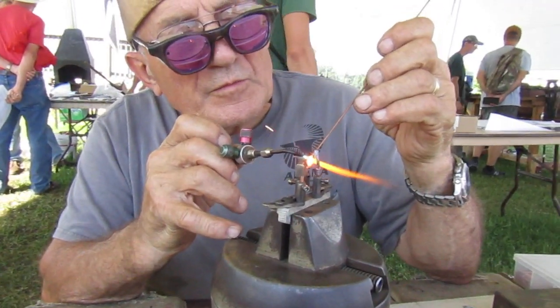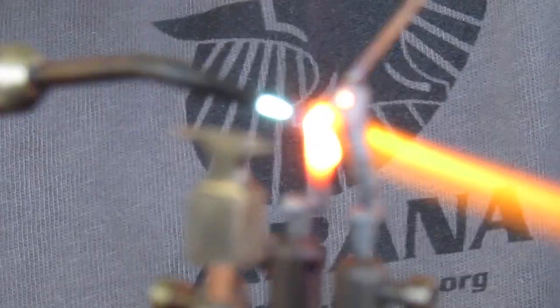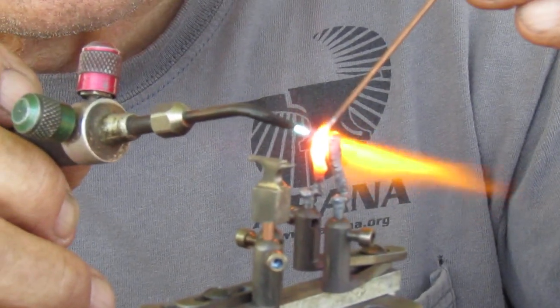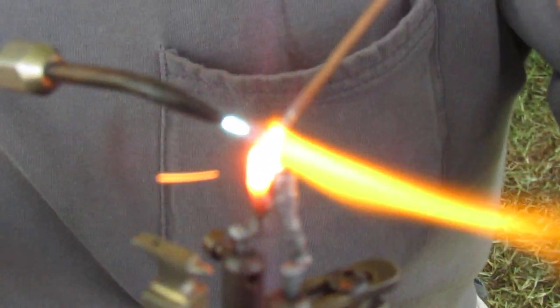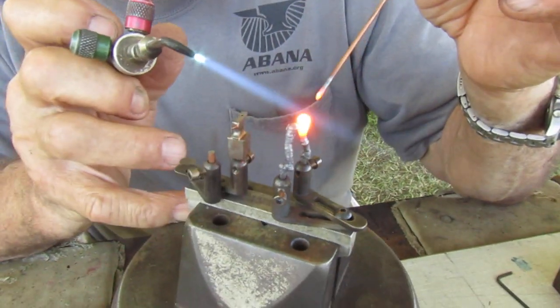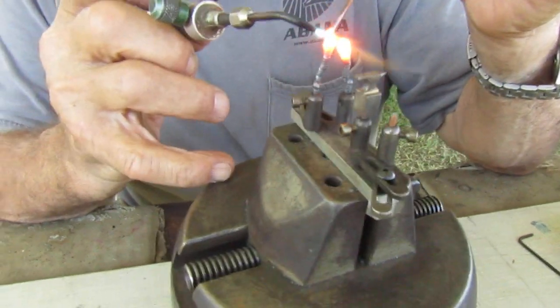What I'm doing here is I'm taking a sixteenth inch steel welding wire and I'm melting it with a small oxy-acetylene torch, and I'm running a continuous puddle of metal. I control the puddle with the flame and the end of the stick, and I can either add or subtract metal with the end of the welding rod. But it's not just a matter of being able to puddle the metal — you have to think of the figure in three dimensions.